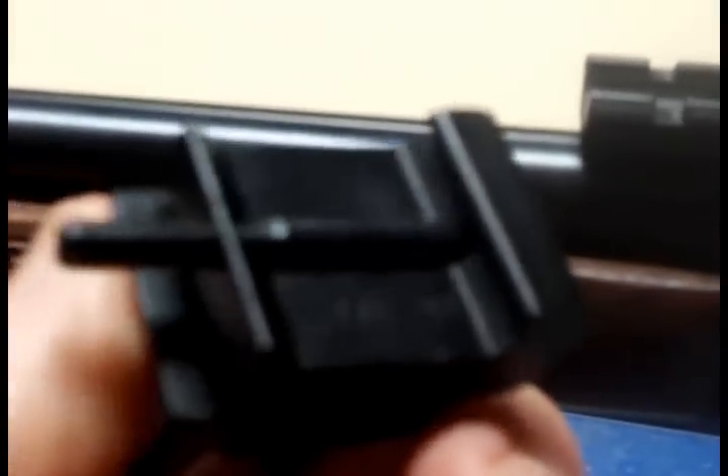It's for an AR-15, and it was supposedly to fit a Weaver rail. It won't fit this because of the cross bolt here. When I measure that bolt diameter, I get 0.18 of an inch. And when I measure these slots in this Weaver mount, it comes out to be 0.13. So although this will go on there, it doesn't go down as far as I would like, and I just want it to be more secure than what it would be.